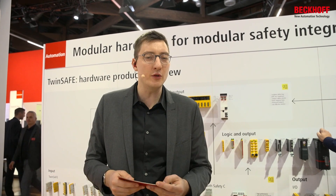I am standing at the safety side of things, and the safety system is very important because every machine builder has to assess the risks which can occur within any installation. An injury being reversible or irreversible is the first thing you have to assess, then you have to check for the frequency of the occurrence, and then you have to check if you can move away from the risk.